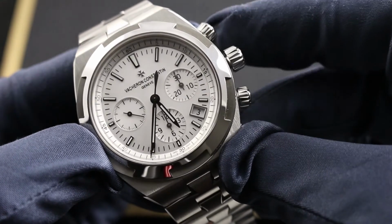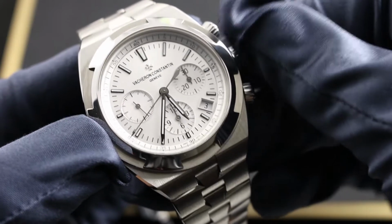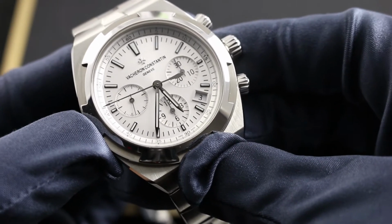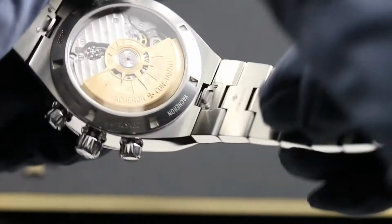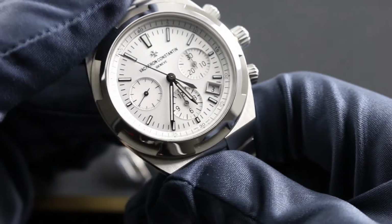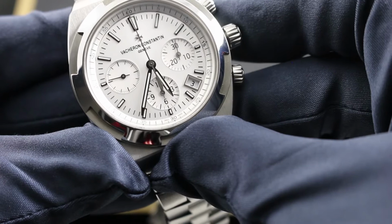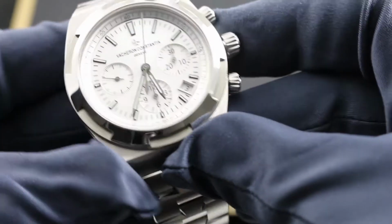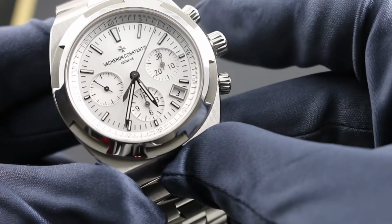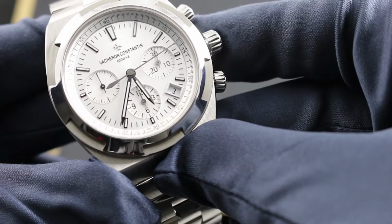By withdrawing the crown from its threaded and flush position against the case, it can be wound by turning the crown approximately 20 turns clockwise, at which point the motion of the seconds hand and the beat of the balance can be independently observed. At this point, the watch can wind itself via the natural action of the case-back winding rotor, or it can be manually wound to its 54-hour power reserve capacity using the crown. It's important to note that this automatic winding watch cannot be overwound by either manual or automatic means, as the mainspring bridle will simply slip when it reaches capacity.